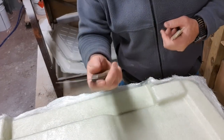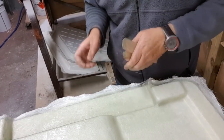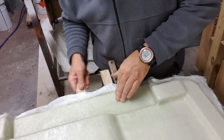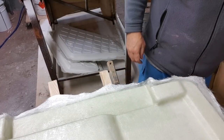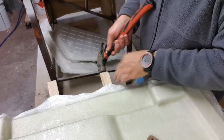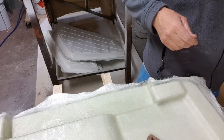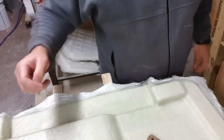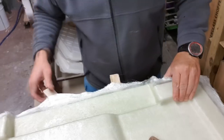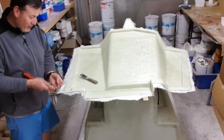What you do is get your tool, try to find a gap — you often have to crack it. Get your wedges and try to methodically work around your product. You shouldn't even need to hammer it, but this one's been a bit stubborn. Get a light tap and just gently break your product and separate it from the mold. Work your way along until you feel it release — yeah, it's already released, which is good. There's another release there; you hear it release.